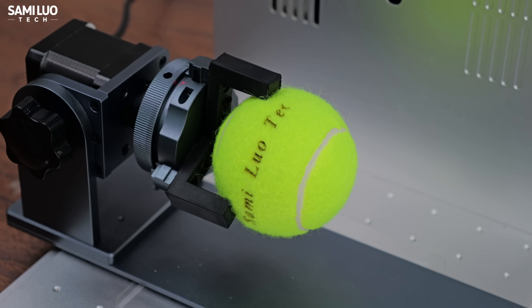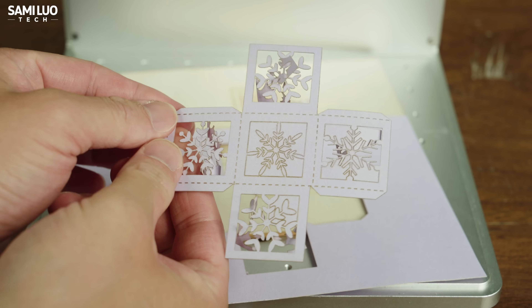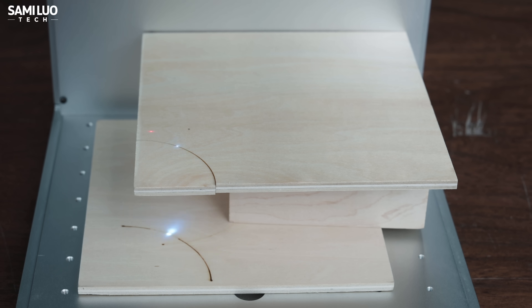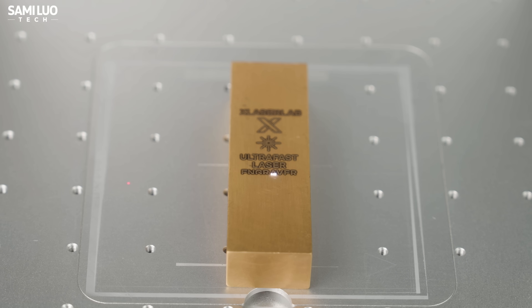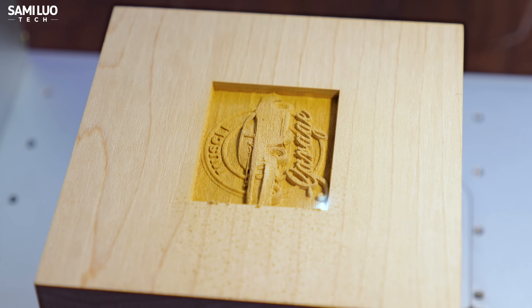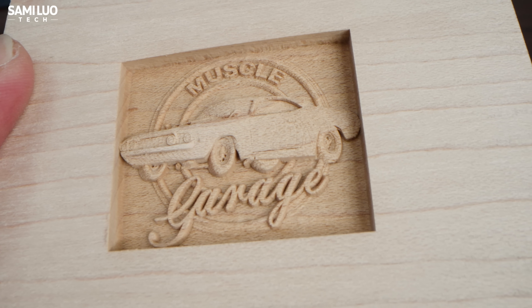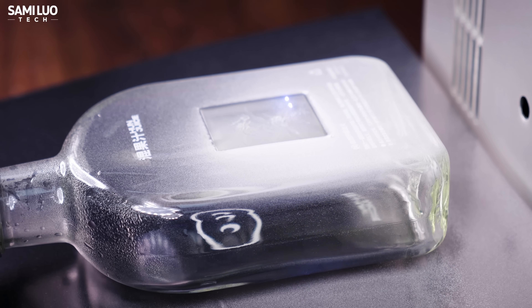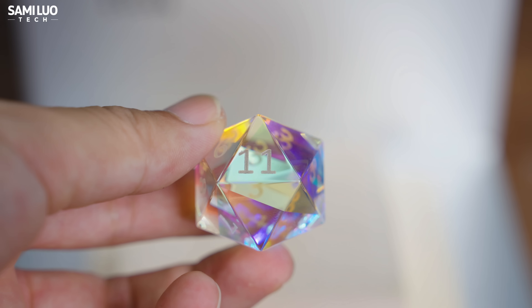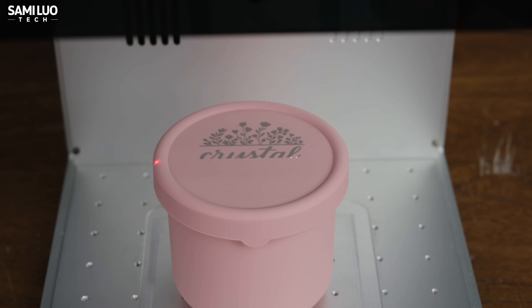UV lasers are considered cold processing — they don't melt materials with heat, they break molecular bonds directly. That's why when I engraved a match head, it didn't catch fire. You can even cut paper with it. I managed to cut 5mm wood with probably the cleanest cross-section I've ever seen, and even 0.3mm brass sheet plus gold-plated metal. Here's the fun part: when doing 3D embossed engraving, unlike diode lasers that leave burn marks, this one stays clean. Check it out on this wood board — it looks like it was colored by a master artisan, no burn marks at all. Even on glass — have you ever seen 3D embossed engraving on transparent glass? Stunning! Since UV light is strongly absorbed by plastics, coated materials, and glass, it leaves razor-sharp, damage-free marks with almost no heat. And it works really well on silicon too — something diode and fiber machines struggle with.